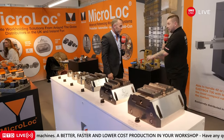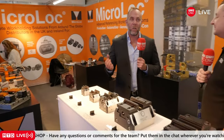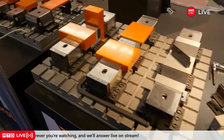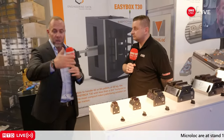Is MicroLock just for three-axis millers? No, and I should have mentioned this. In fact, a good half of our turnover over the last year has been on cubes. Very few people can make custom cubes in the UK, and we can — anything from about 150mm square by 400mm high up to 630mm square by a metre high. We machine the MicroLock system into the faces of the cubes; it can be four-sided or two-sided, and all the standard vise systems sit on that. We have standard sizes to suit 400 and 500 pallet machines, but can make anything to suit customer requirements.